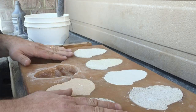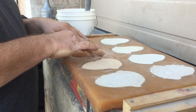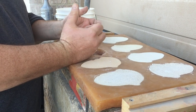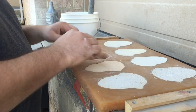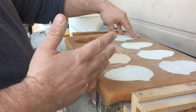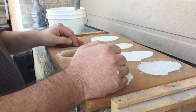One of the things you want to do is make sure that you have your mortar ready to go and your rubber molds ready to go. If you're doing a larger mold with a lot of intricate panels, you may want to use a release agent — a mold release agent. Some people will use just dishwashing liquid, sometimes watered down a little bit. There are other release agents from Polytech and Smooth-On, but you don't want to use one that's oil-based, as it will absorb into the masonry you're casting.